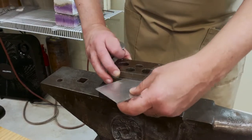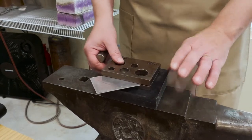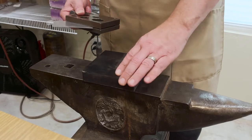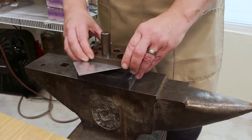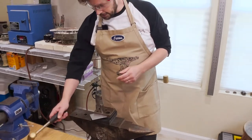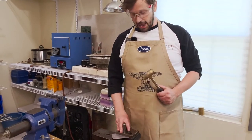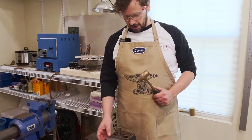I'll place the metal into the disc cutter with the right size punch. I tend to cut on a more stable surface like this anvil, but I'll put something down like this heavier block of plastic to protect the anvil as the punch comes through. You do want to have safety goggles in case there's a little bit of metal that comes off as you're striking. Anytime you're using a hammer and punch you always want safety glasses, and if you're doing a lot of this, hearing protection could be a good idea too.